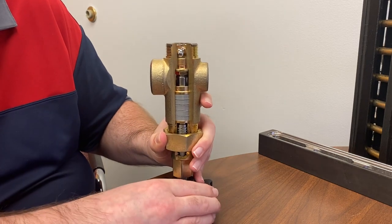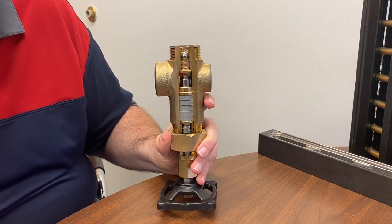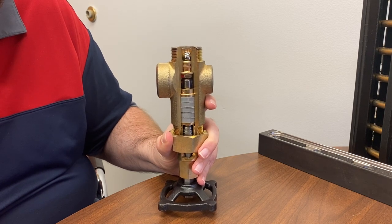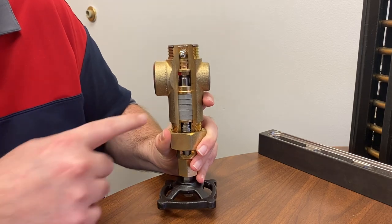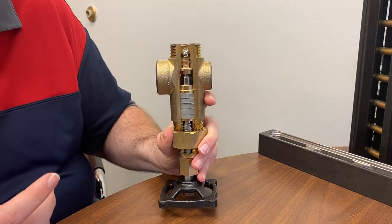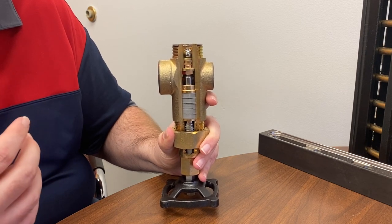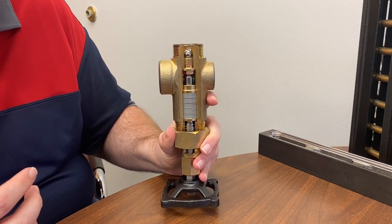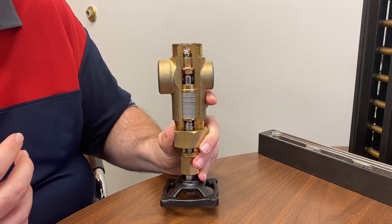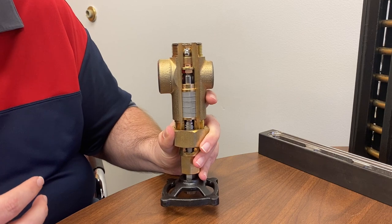The standard commissioning procedure: the first step is to open the valve a quarter turn or a half turn — that's all that is. As you can see, the ball check is still not seated in the seat, which is very important for commissioning. The stem is no longer engaged with the seat, and that will allow fluid to flow through the valve and into the gauge.